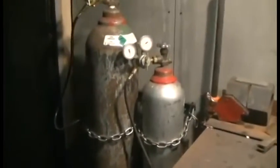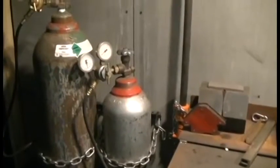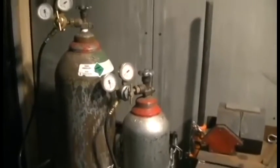That gives me a very large work surface. The two bottles for the shielding gases - I've got my argon mixture in the big cylinder and the argon CO2 for the MIG in the little cylinder. They're properly chained to the wall and I've got the regulators attached, so they're pretty much ready to go.